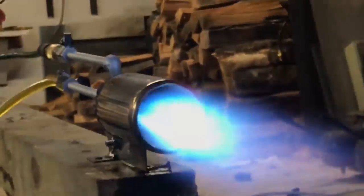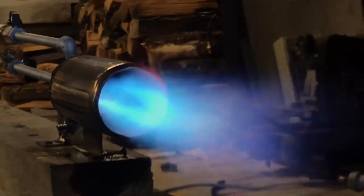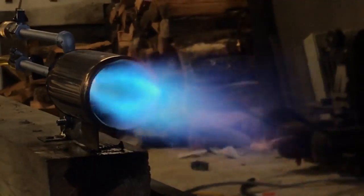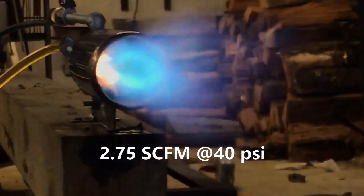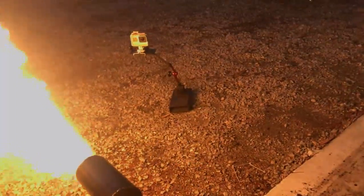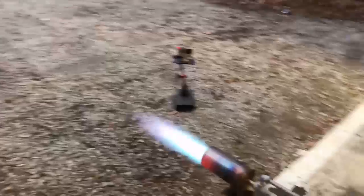We see yellow flame. There's got some rotation in there — oddly, I would say about a thousand RPMs. Every once in a while it'll really pull loose. You see that spin there? Probably about a thousand RPMs or so. And there is nothing geometrically causing that to happen, it's just doing it. Our secondary air is just not enough — that Venturi isn't pulling enough. The turndown rate on this thing is great, you can turn it down.